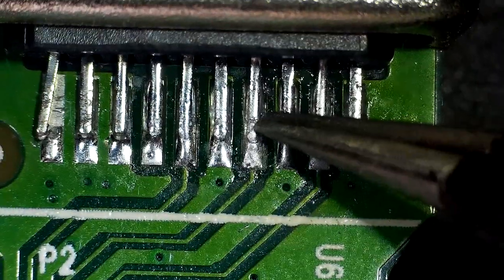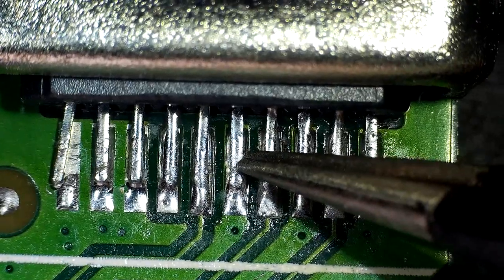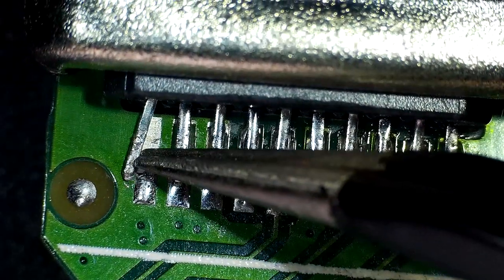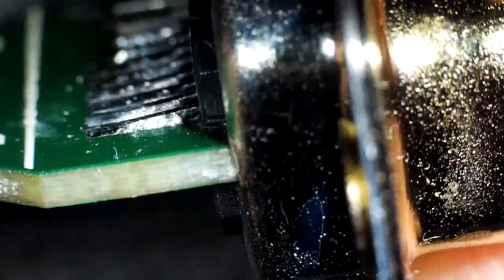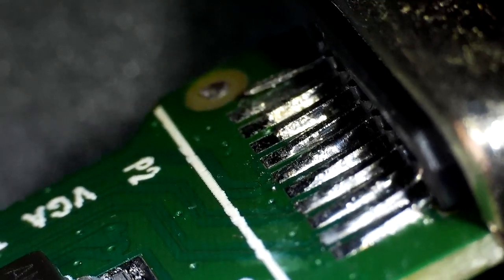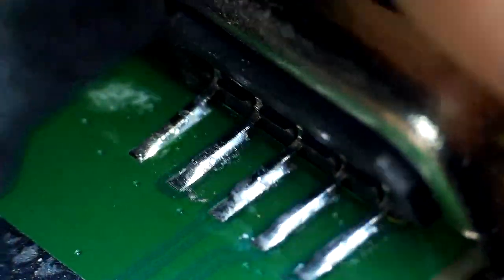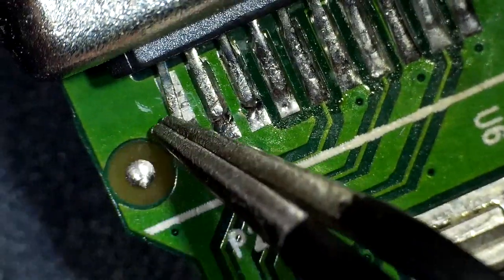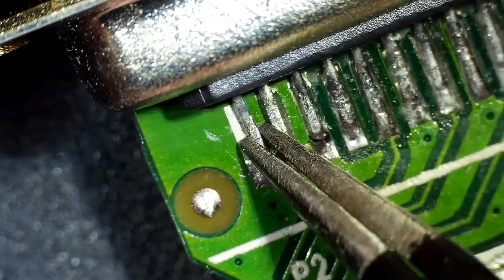There's not that much latency when using this. I have shaky hands, so the best thing I've found is just to brace myself against the board. Looking at it from the side, this thing wiggles — that's not good. You don't want something to wiggle when it's soldered. We can see that one of the pins has come up at the end, and that's part of the reason for it wiggling. The other part is they didn't design any strain relief in this. Also there's not that much solder on that pin, and the pin next to it seems a little bit sus too.